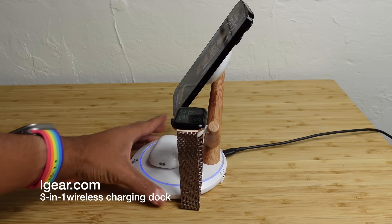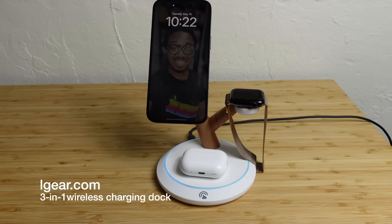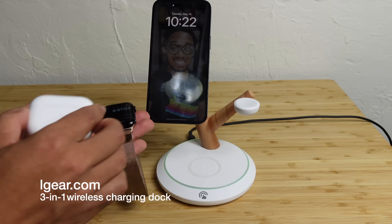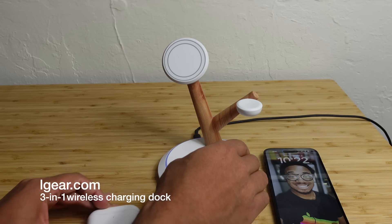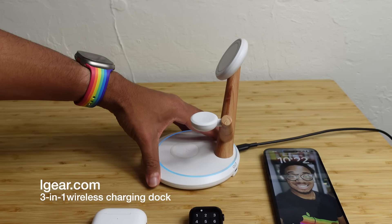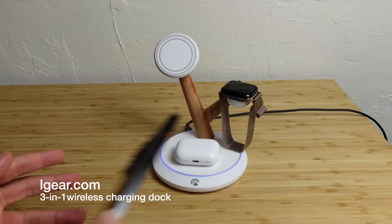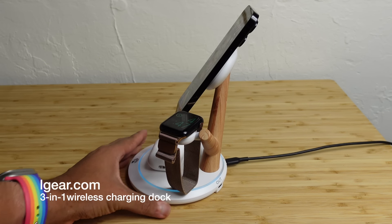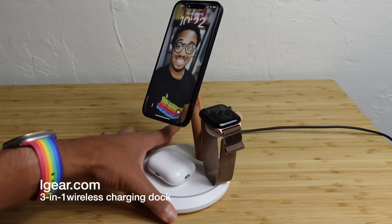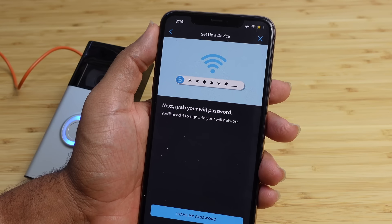This is going to be set at home. I've typed in our address and entered the location name, and I'll go ahead and hit save location. Location has been saved and now I can give this doorbell a name — you can name it front door, back door, office, or use a custom name. We'll name this office. Caution: if you use the wrong screws to secure your Ring doorbell, you could damage the battery during installation, create a fire hazard, and be seriously injured. Do not use any screws other than the included short security screws when securing your Ring doorbell to the bracket.